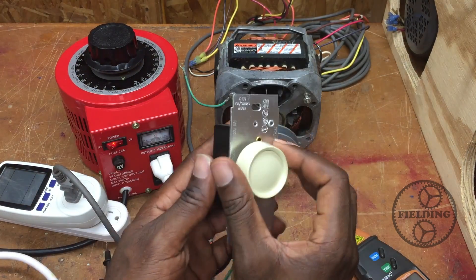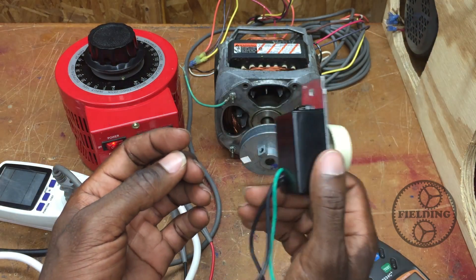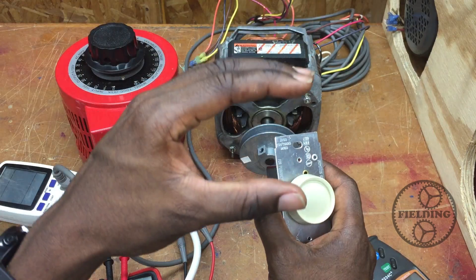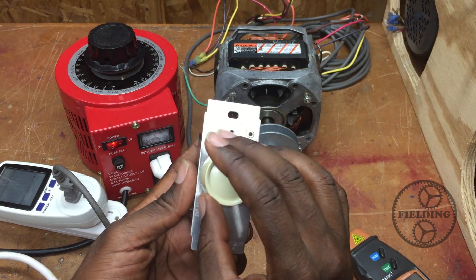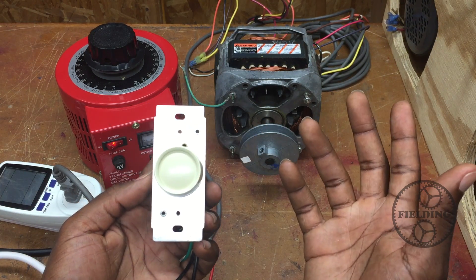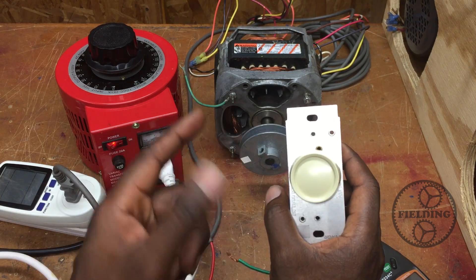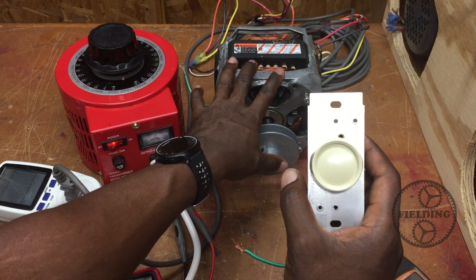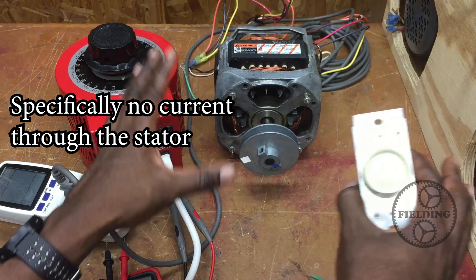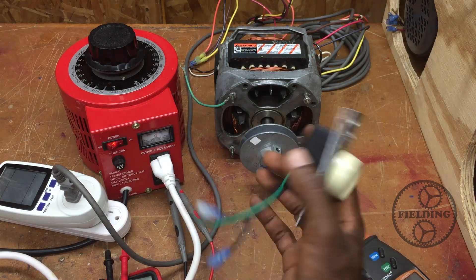What about something like a light dimmer switch? These have a triac inside. Old dimmer switches used a rheostat — a variable resistor that increased resistance in the line to make lights dim. Modern dimmers actually flip the light on and off very rapidly, so fast you don't see the flicker — you just perceive it as dimmer. When you do that to a motor, the motor is being switched on and off rapidly, so there's no voltage for brief periods and the magnetic field is gone. The motor will coast intermittently.